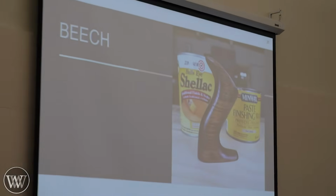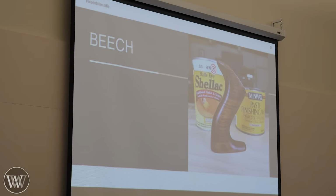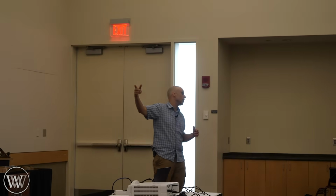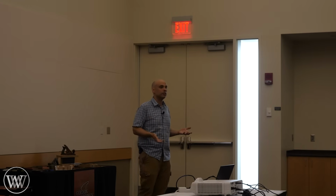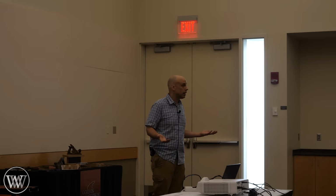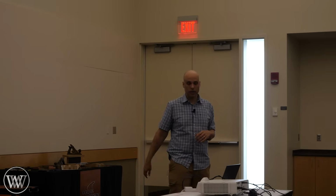And then after that, what I really like for all of my knobs and totes is just shellac. Again, I'm a heretic. I use the stuff out of the can. You can all throw stuff at me now. I don't mix my own. I just use this nonsense over here. I've had very good luck with it. And then I buff it out with steel wool and finish it up with Minwax paste wax. And I have planes that I've done this way that I've had for over 10 years that have held up really nicely. And I find that I can get these tools back to the bench super quick this way.